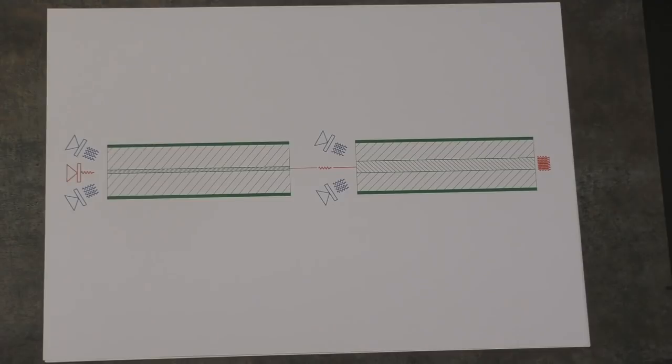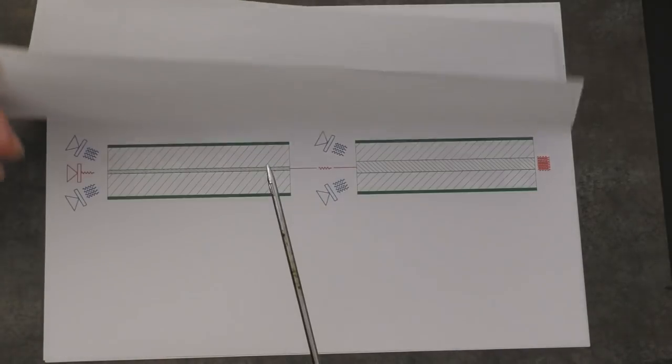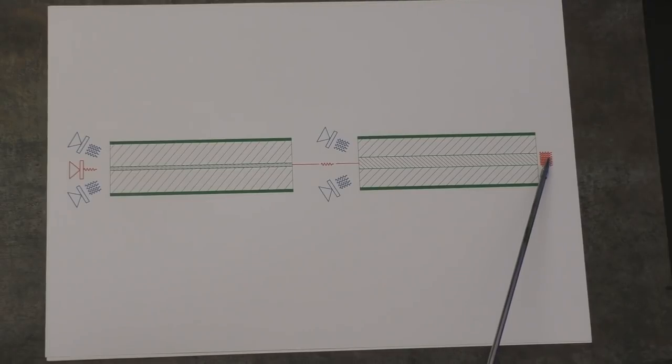Eventually we get to the most difficult part: trying to understand how a MOPA laser works. It's not the same as any other laser we've talked about. Yes it's got a core and a cladding, but it has no mirrors — that was a big problem I had to start with. Then I realized something significantly different: this one has an injection of a signal down into the core itself — not just a pump signal, but actually a signal which runs through both lasers and comes out the other end in a fully amplified laser format. Bear in mind this explanation is how I've interpreted it after many hours of reading and research — nobody has told me exactly how this thing works.